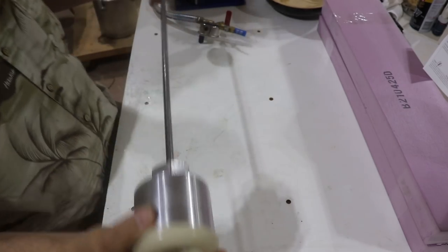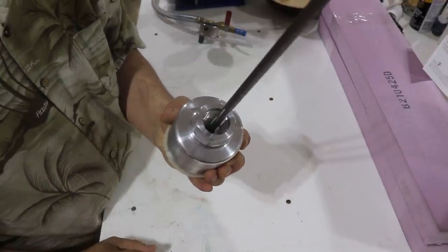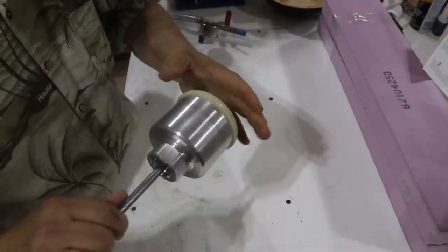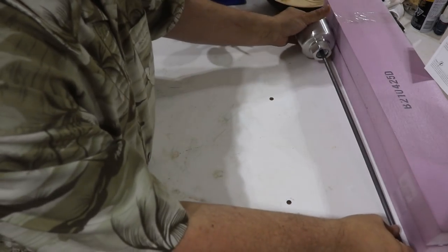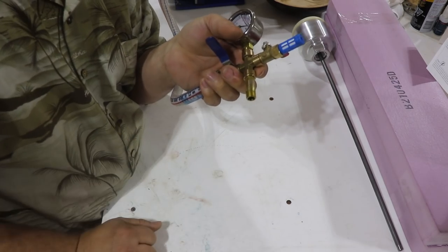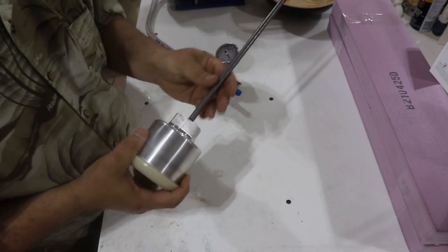What this is: it's just the shaft that goes through your headstock, the vacuum chuck head itself, and it has a bearing in the center. You can buy them with different thread patterns — I have a 1-1/4 by 8 thread on my lathe, so this threads onto my headstock. The shaft goes through the hollow headstock and you hook the vacuum hose on the other end. This part doesn't spin; all the spinning happens up at the chuck head. It's pretty simple — there's no swivel adapter required at the other end.